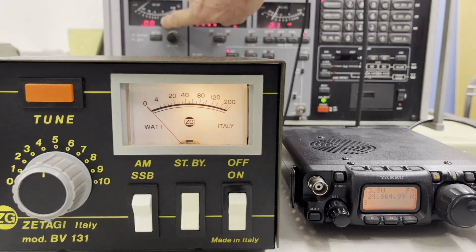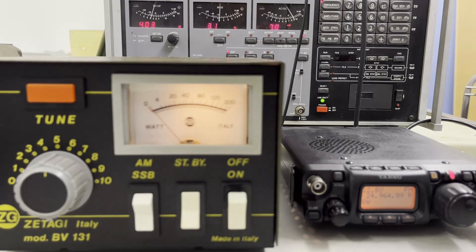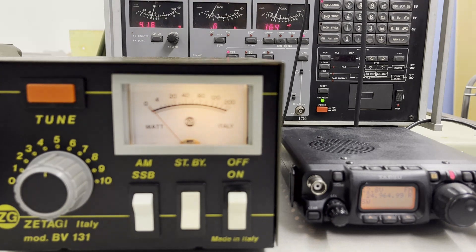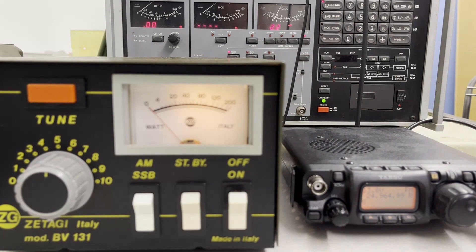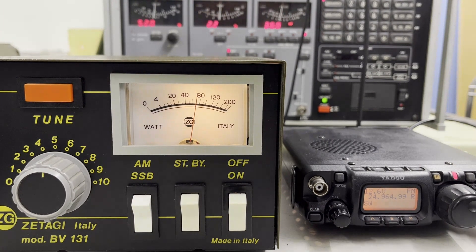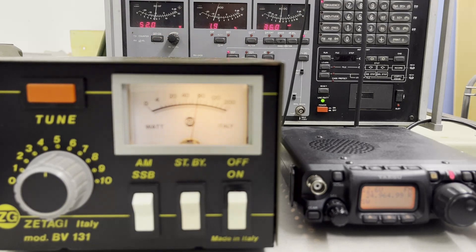I will TX on FM so you can see it's about 4 watts here. Now I think the amplifier is ready for TX — standby off. Wonderful! The needle shows me about 80 watts, but on the test equipment it's reading about 52 watts. It's not tuned yet, so I will tune now.